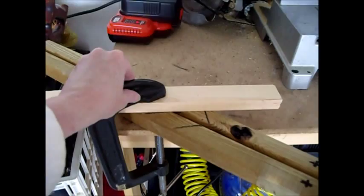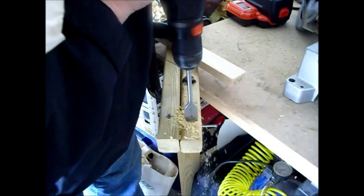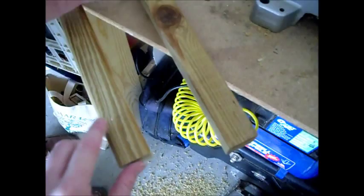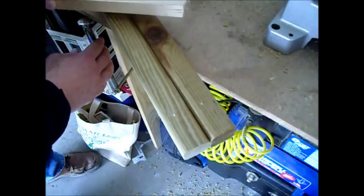Here we're just bracing with another piece of wood so we get a nice catch. Be sure to keep your drill straight — this might take a second person. These boards aren't very wide and you've got to really hit it. Now you just want to turn these over before you break completely through, and you can see the little holes from the paddle bit. That's your center line. Make sure you break through from the other side first — this will keep them from splintering. We just drilled it with our one-inch bit.